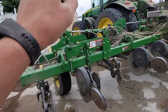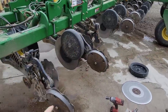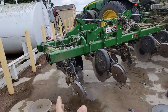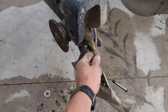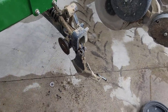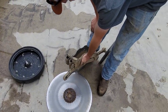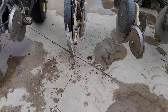The reason this row here was leaking worse is that row one gets a rate and a half - there are two tubes putting out in the same row. We're side dressing 15 rows but covering 16, so the outside row gets a rate and a half. Row three has a single normal rate, no vapor tube, no wheel track - it's got the easiest, nicest conditions to seal in as possible. Therefore a bent arm just a little bit probably won't make as big a difference there. And confirmed - that arm is bent because the one now on row three is not centered.